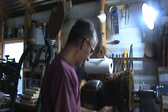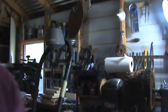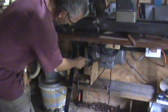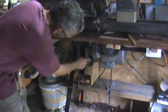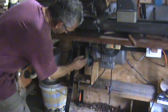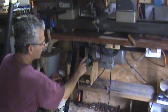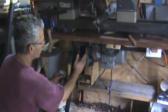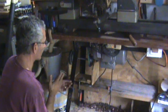My homemade tool rest and the reduction gear on the lathe — here's what I came up with. I got the motor, I built a counter shaft, and the counter shaft has two pulleys. It has a one-to-one ratio on this side so I can bring everything back to its original speeds, and then I have a one-to-two ratio — a two-inch pulley here and a four-inch here.